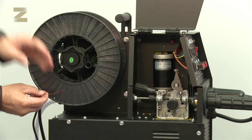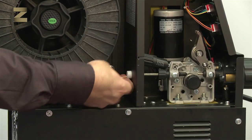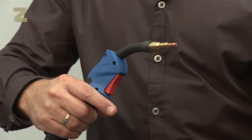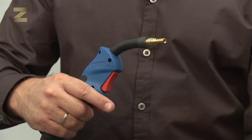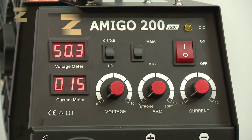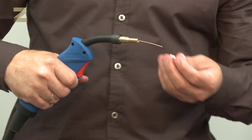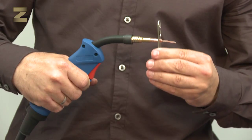Now you can see the motor and two drive wheels of the wire. Insert the wire through the guide into the feeder until it reaches the handle outlet, and secure the clamp on the wheels. You must remove the nozzle and contact tip to allow the wire to pass through the handle freely at the outlet. Now insert the plug into a standard 220 volt socket and switch on the machine. Set the control to MIG welding. Use the control to quickly take out the wire until it is completely out of the handle. Mount the contact tip back on the handle and then the nozzle.